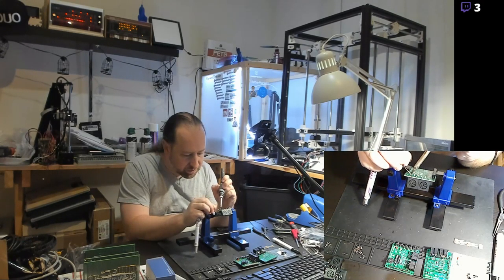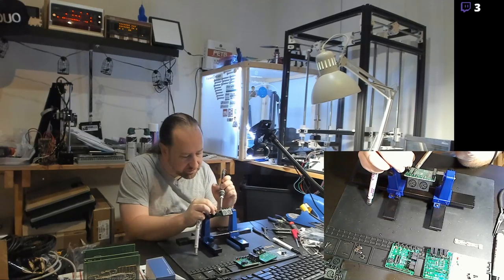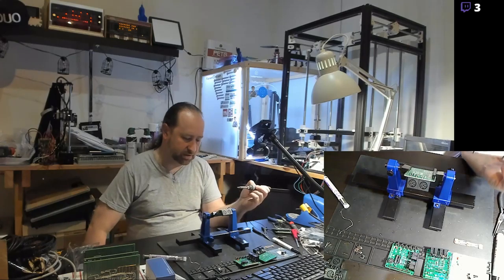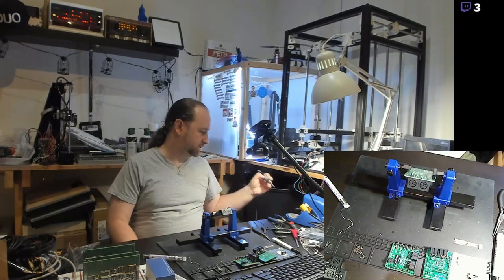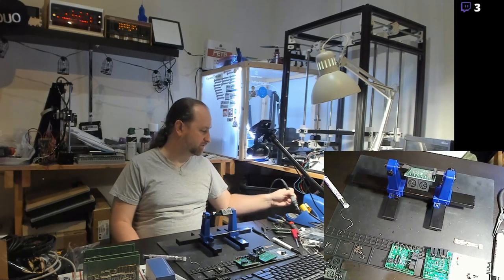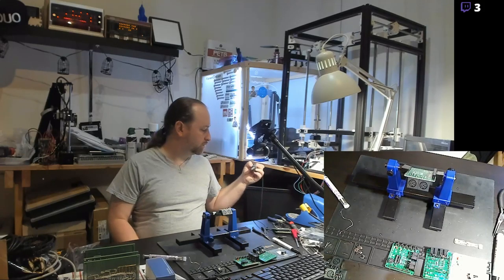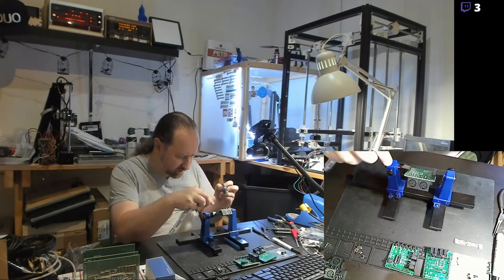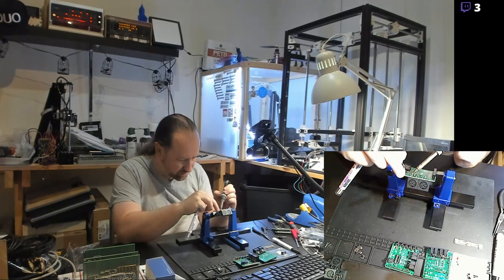There's a couple of ways to build these boards too. There's a simple way to build an interface board which requires very little other than just a level shifter attached to a Raspberry Pi, and that's kind of neat. The downside is there is a limit on the amount of current that setup can handle, and if you connect more than, I think it's two or three devices to the serial bus, you can actually burn out your Pi.